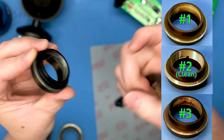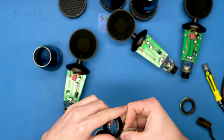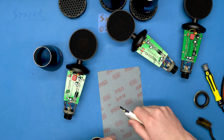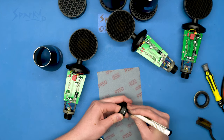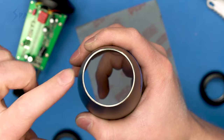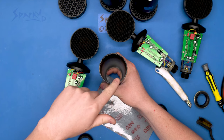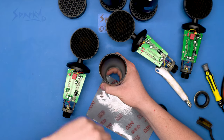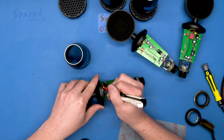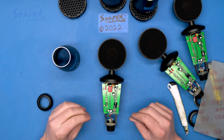There's a fair amount of overspray on these threads. I'm going to try to get that off with this wire brush. We're just going to sand this ridge here at the end a little bit. If you're having trouble with the sandpaper, you can also use a file or scrape it off with a corner of a utility knife. The important thing is to get good contact. Once you've got the end cap looking nice and clean, take a look at the body — you can see there's some paint on the inside of it as well, so we're going to clean that up too. Nice and shiny. I'm also going to clean up the inside of the top, so we can try and get good contact on both sides. And of course, you've got to get it on both sides. And that's all you need to do to fix the problem. Let's put this back together and give it a test.